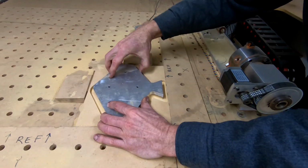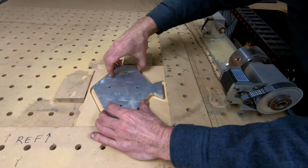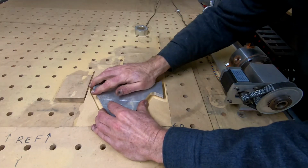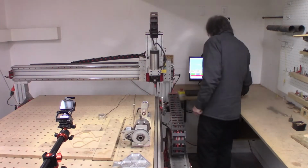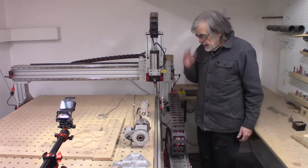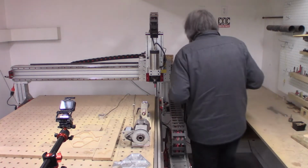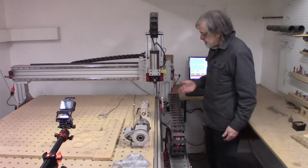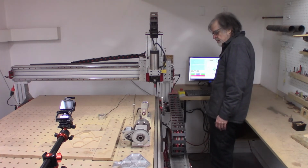Oh boy. That looks like, that is right on the edge of fitment. Gadzooks. I could probably hammer it in place. So I am going to go back to the CAD room and give it another 2,000ths, I think. Okay, another 2,000ths. And in this case, because the tool hasn't changed and the workpiece hasn't changed, I don't need to do a measurement here.